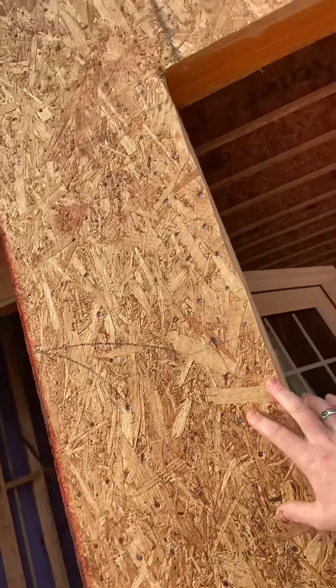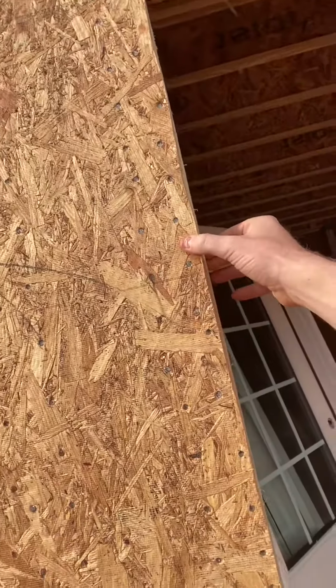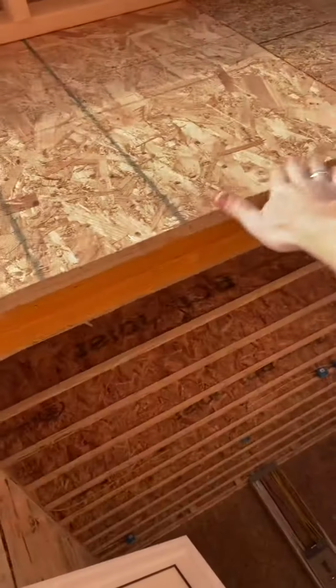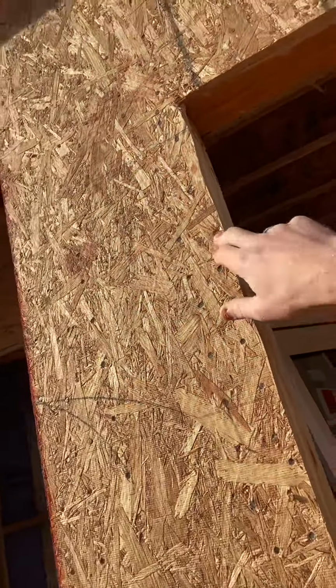We're gonna look at another 3x3 grid. This is a better pattern. Notice the beautiful flush nail heads. This is good, but you needed one row here, one row here, one row here, one row here, and a 3x3 here. All this extra 3x3 nailing is unnecessary, okay?